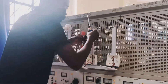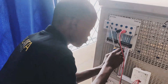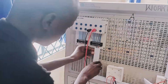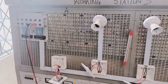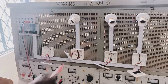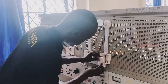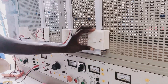That's the termination taking place. We also take the live from the circuit breaker — or you can loop from the first common on the two-way two-gang switch — direct to switch four, and that will be working as a one-way switch. We are now doing final fix with the screwdrivers. The lamps are all fixed. What's left is to fix the screws to the patresses to make it look clean and neat.